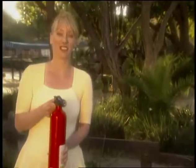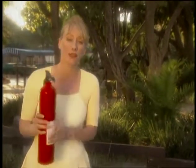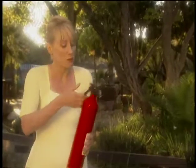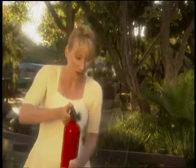A liquid turning to gas, just like water turned to steam. Before, when we made water turn into steam, we added heat. But where does the heat in this fire extinguisher come from? From the liquid CO2 inside. When the CO2 liquid passes through this tiny little valve, some of its internal energy, heat, gets used up to vaporize it, and it comes out cold.